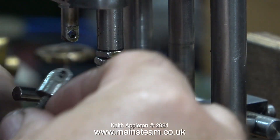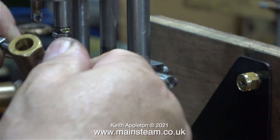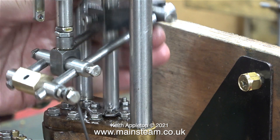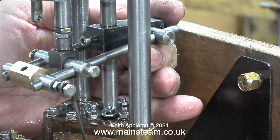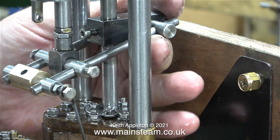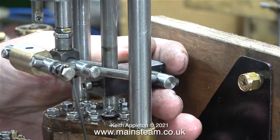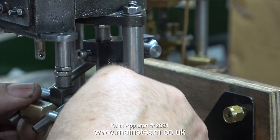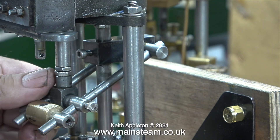This looks to me like a bit of a bodge done by someone who didn't build the pump but tried to repair it in the past. There's a piece of steel tube silver-soldered in the block and it's too close a tolerance fit on the threaded shaft. Analyzing the mechanism, it is most important that the two long pieces of steel bar that go through the piston block, the fulcrum, and the valve block are only fixed on the fulcrum, not at each end. I drilled the hole a good bit bigger than it was, and I ground away the excess tubing at both sides of the valve block. Here I'm making sure that the bolt with a lock nut that drives the mechanical lubricator doesn't go all the way through and lock up the drive bar.